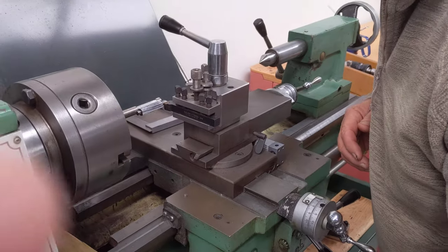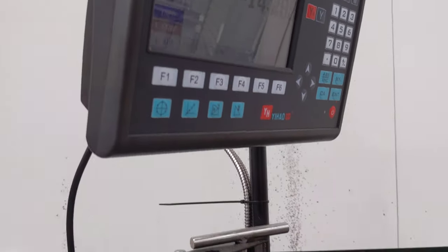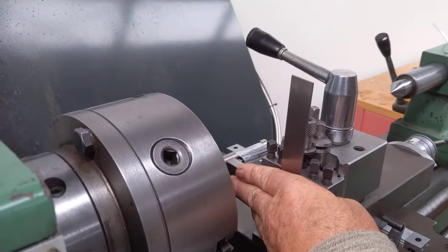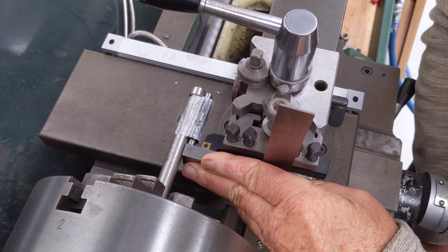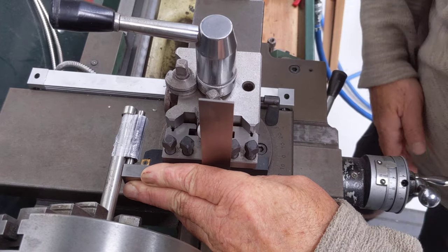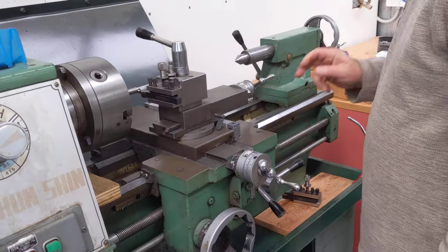So we just touch it. There it is, just touched — so we then hit the X. And now we do the second alignment, coming along here. There it is just touching. I go up here and hit enter. And it says X axis set okay. So that's all done — it's actually auto calibrated both the scales to the calibration block.